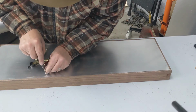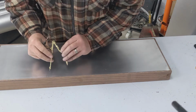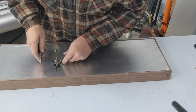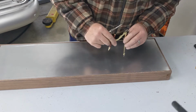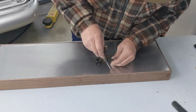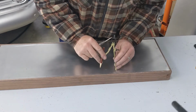And then to the next step, I will punch these with a hand punch, probably. If I have the correct die, it'll be a lot easier than on a drill press. And since I have this punch made, the die has a little dimple and it centers on that punch. So it makes it pretty easy to get an accurate hole.